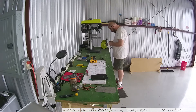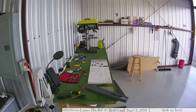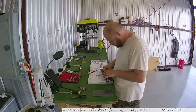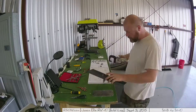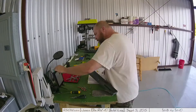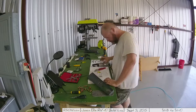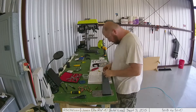It's pretty well documented as to what you're countersinking, so no big deal there. You'll notice through this entire process I spent a lot of time staring at the instructions — this whole thing was a little weird, a bizarre setup. Here you can see I've already primed everything, so this is a couple of days — maybe even a week — later. I begin the process of actually riveting things home, which is always a good time. I love working with the squeezer; if you have it set right you get good results every single time. None of the pieces were particularly difficult to rivet on this one — everything just kind of came together nicely.